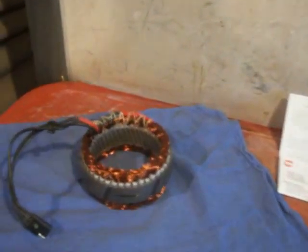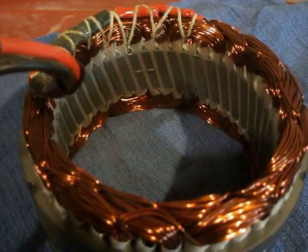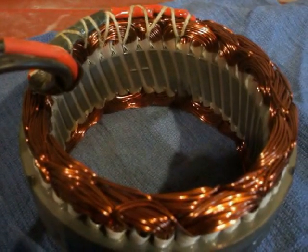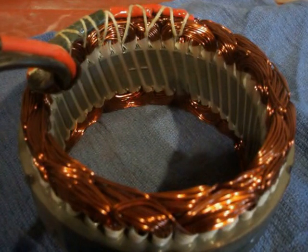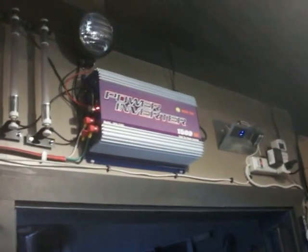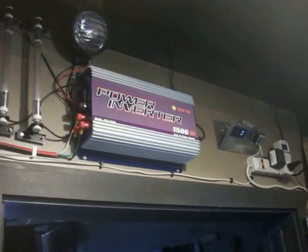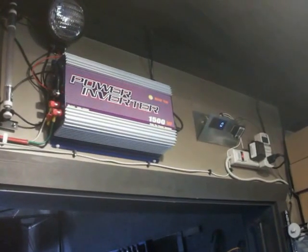All PMGs are not created totally equal. Here's another look at the core I pulled out — I noticed the laminated plate has a flaw in it. Looks like two or three are sticking out a little further than the rest. This is from that 12-volt unit — will it make a difference? Probably not. What the company that makes these needs to do is figure out a way to make the cut-in speed a lower RPM than 240, because then I wouldn't be forced to modify. With the wind I've got, they just don't make enough power — that's why I had to modify mine 2-to-1, trying to get the RPMs up. Well, it failed, but we'll see what the other blades do.